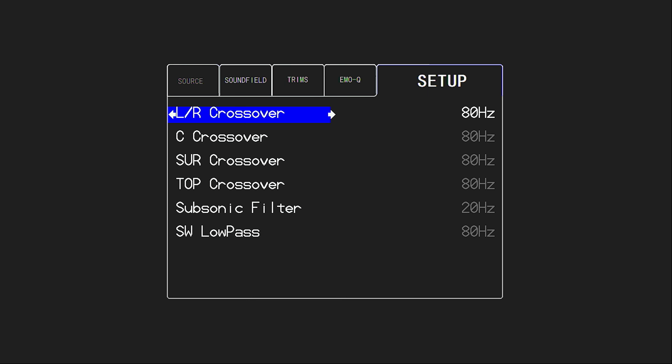A rule of thumb I often recommend for your crossover starting point: look at the frequency response measurements for your speaker. If the speaker plays down to 50 Hz in its specifications, I usually recommend overlapping by 10 or 20 Hz into that low frequency response — so if it plays down to 50 I'll do 60 or 70 Hz, just to make sure I'm eating into that natural roll-off of the speaker a little bit. If my center goes down to 80 Hz, I'd go up to 90 or 100. It's up to you to set those points.